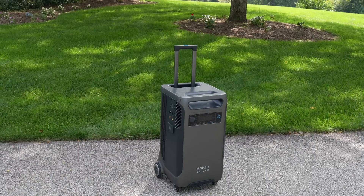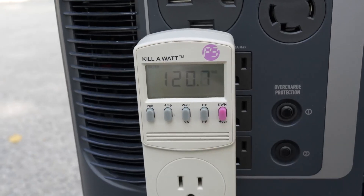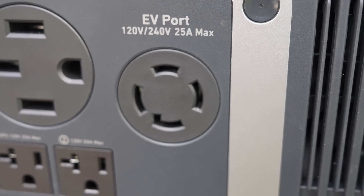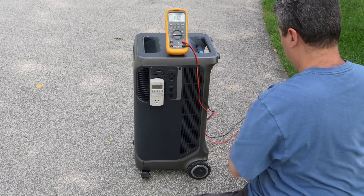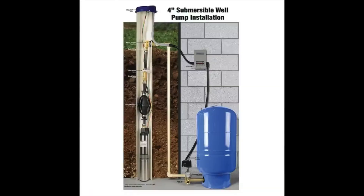This Anker isn't the first product that can do 240 volts, but until now you always had to buy a pair of devices along with some type of a combiner box. This one has the holy grail of outlets — it's the L1430, a 240 volt outlet that is a common standard in the U.S. on gasoline generators. You can run things like well pumps and electric dryers.